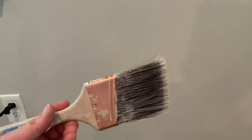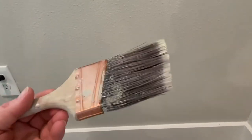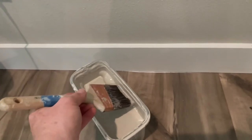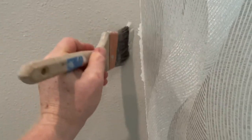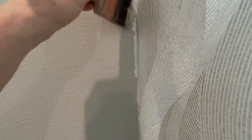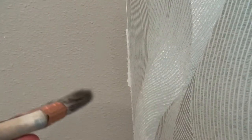So how do you do it? You get a good quality brush and you wet it first, shaking off the excess water. And if your customer is really good, they'll store their paint not in a can, but in plastic — very good idea. Then you get to it. You put the paint about an inch away, and then you bring that line nice and straight right up against your wallpaper.